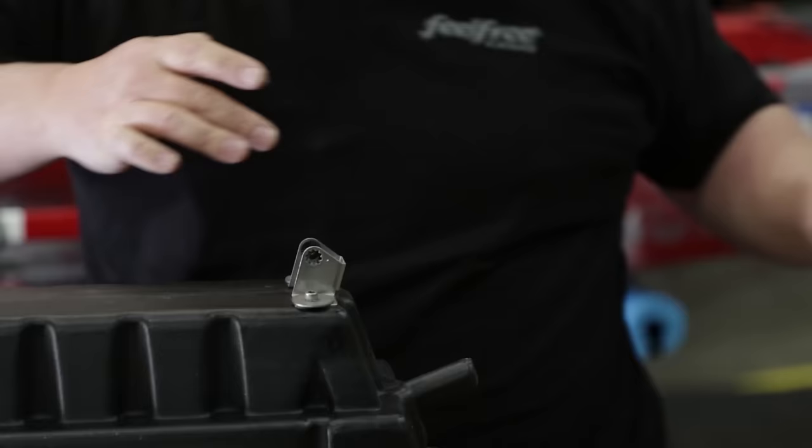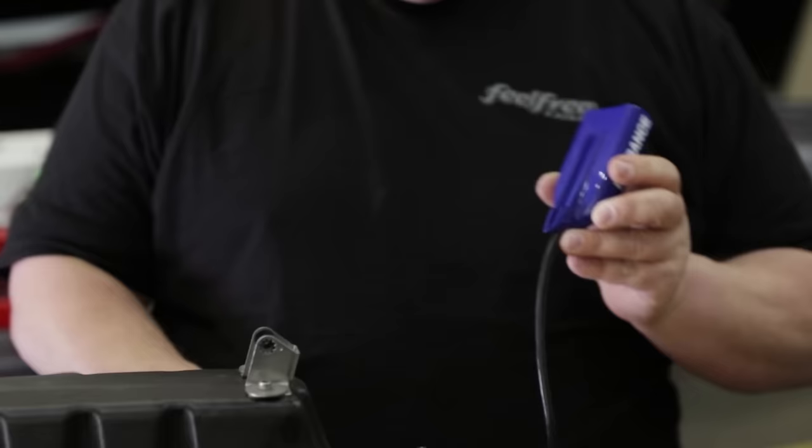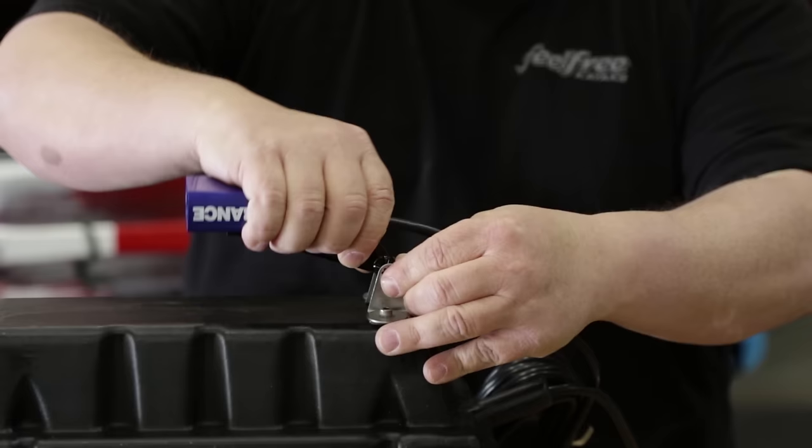Now both of my stars are in there. Take a towel, wipe the excess silicone off my hand. This is our new Lowrance HDI Exonic Transducer — it's got a nine-pin connection to work with the Elite TI units. I'm going to take my slide, put the slide on here, seat it into place. Now like I was talking about, these little stars hold the ratchets in here. We're going to slide this right into place. As you can see, everything is going to be held into place nicely.